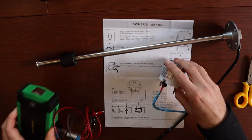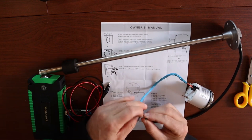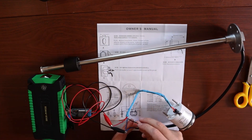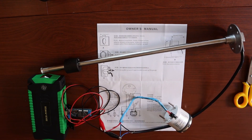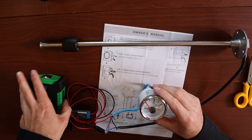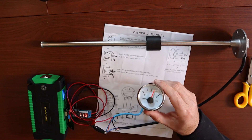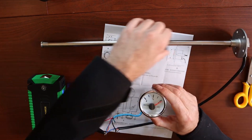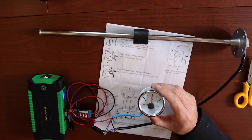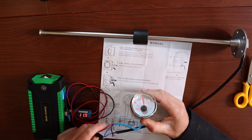Let's demonstrate the connections using a power bank. Red to positive, the two blue wires connected together to the negative of the battery, and the black signal wire of the gauge clock connected to the brown of the sensor. With everything connected, we power it from the power bank and we can see it starts up. Now if the level on the sensor varies — from maximum to minimum — the gauge gives us any measurement in between. Really simple to connect. The orange backlight cable can also be connected to the power supply and as you can see, it lights up, while the needle continues to work perfectly.